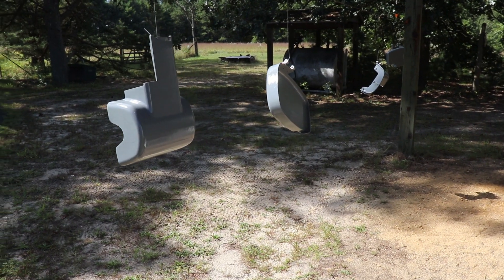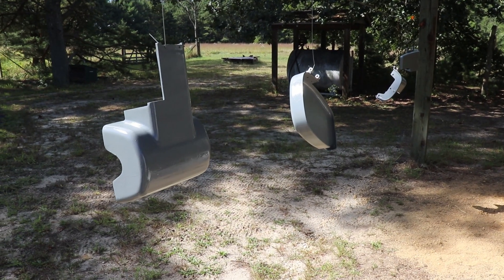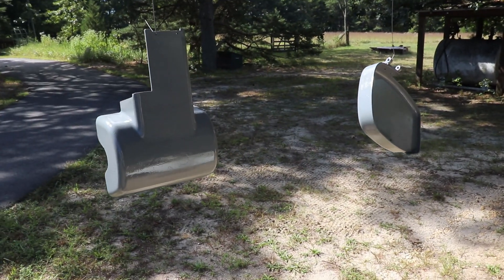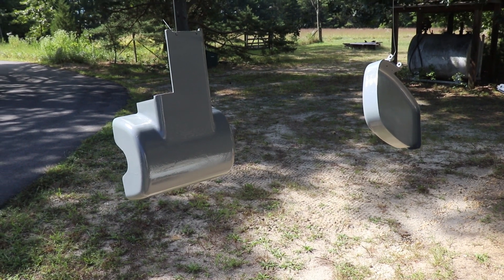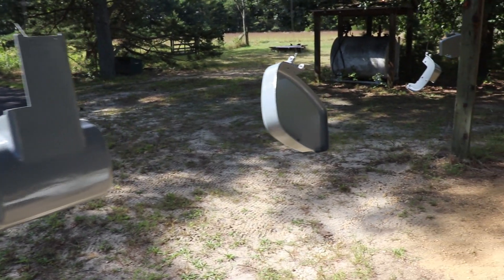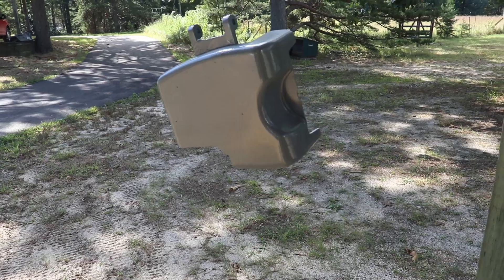Here you can see the covers I removed — this is the first coat of color coat that's drying. Most of these are cast aluminum parts, so I lightly sanded them, hit them with a wire wheel to knock off the flaky paint, then used two coats of self-etching primer. Now we're working on the color coats and then we'll do a coat of clear coat.